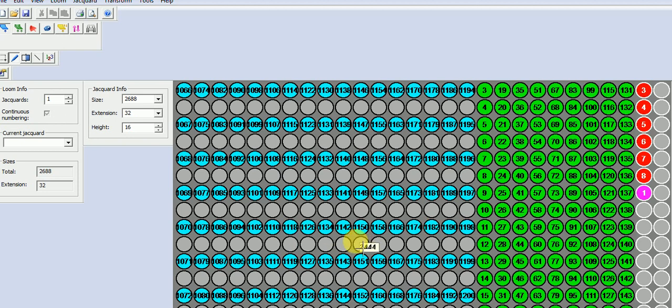And also you have to make the warp thread as per 84 warp threads, the warping beam also you can make with 84 ends per inch. So in the same loom you don't change any harness physically on the loom, you just change here in the loom editor, you just cast out the loom. So this is very helpful to us, like saving money and saving time by not changing the harness.